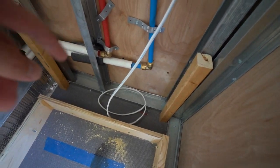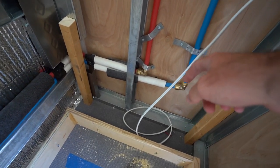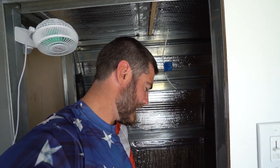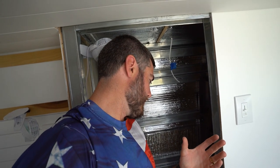That extra space will also allow me to run the electric to the ball valve and run the hose for our Nature's Head toilet. The next thing I want to work on is the drain. The shower pan that I have has a 2-inch diameter drain, and we are going to drill a hole saw through it. One thing you want to do before you make your cut is make sure that your hole is not next to the frame of the van — if you drill into the frame, it's not going to be good.